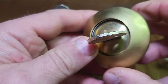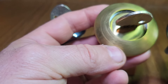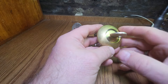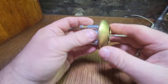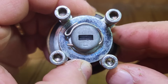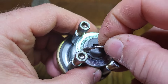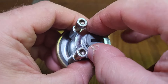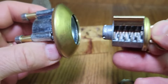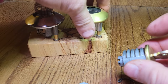First things first, this is a regular Ingersoll. All I've done with this one is machined away part of the center section, which allows — when you undo the cotter pin at the back — it allows the core to pull out. I've also replaced the cotter pin with a nice stainless steel circlip which I've made. All we have to do is pull this up and pull it out. That cap just pulls off, so we can pull the core out. The core just slots out the front, so now we've got an empty housing and I can take this apart without any need for any tools.